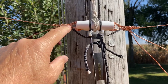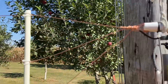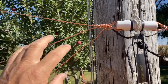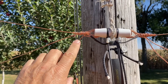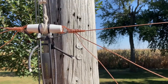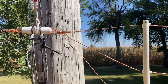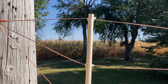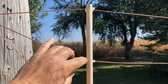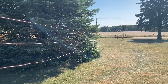Basically, I've got the 80 meter wire, which is my longest, going to be the support for the whole antenna, so that's pretty tightly spliced around itself along with the feed line wire, and then I've got the 40 and the 20 meters wrapped in there behind it as well. It's a bit messy but it's solid. I've got some PVC spreaders, these are 13 inches long, and the wires are 6 inches apart — coming in a half inch, then 6 and a half inches, then 12 and a half inches, so everything's separated by 6 inches.